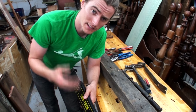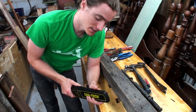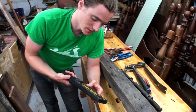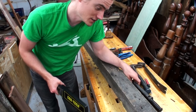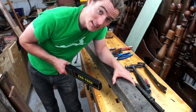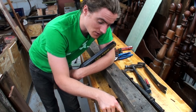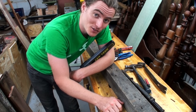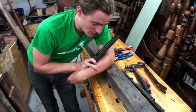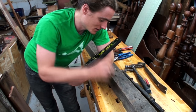Sometimes there'll be a nail right beside another nail — you think you've got it, but you left one in there, and then you hit it with your planer blades and you've got a gouge in your blade. Even one of the beach metal detectors can work. Just make sure your metal tools are away from the area when scanning, and if your workbench has any metal in it, get the lumber up onto plastic sawhorses or away from any metal to avoid false positives.